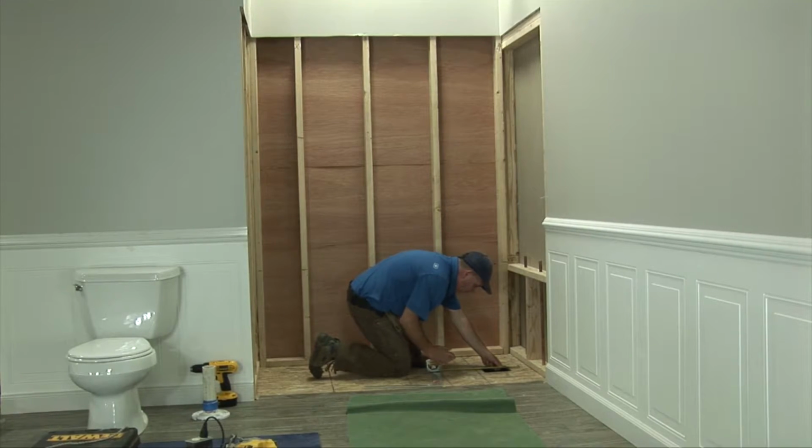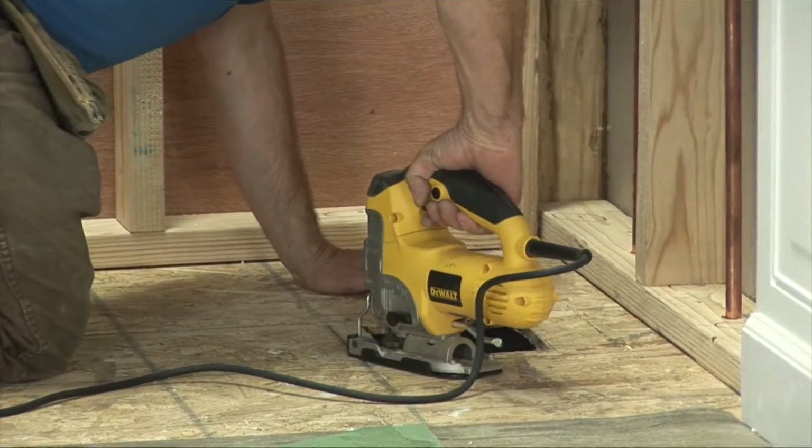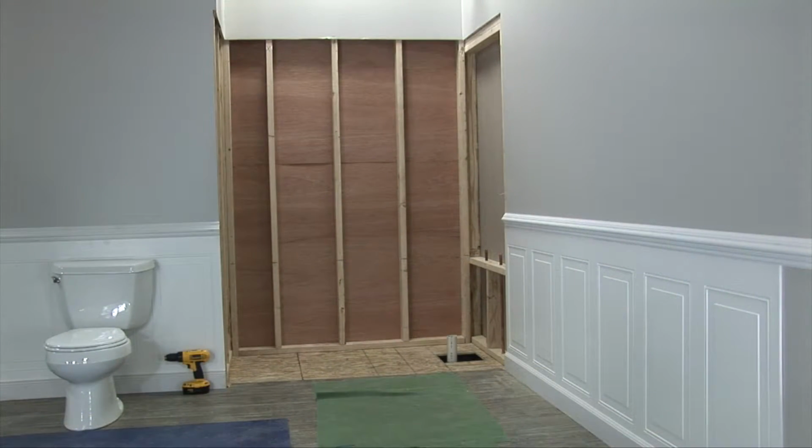The details for the drain core area can be found in the instructions on the framing diagrams page. A 10-inch by 10-inch opening around the drain is required to receive the shower pan and prevent the drain area from being pushed up out of its engineered position. Failure to do so will cause puddling in your shower. Stub out and extend the drain pipe 2 to 4 inches above the floor.